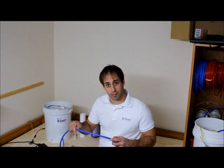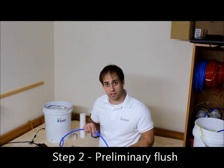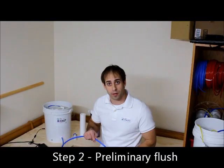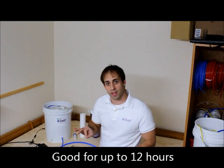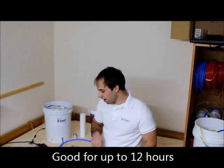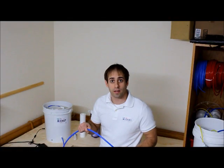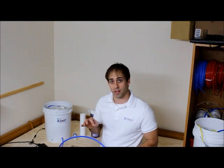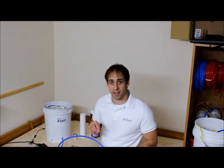Let the system run completely dry until it starts passing air. At that point you're going to go to step two, which is your preliminary flush. You're going to want to insert your intake suction strainer into five gallons of permeate water, leaving the needle valve completely open, and let that five gallons run through the system at full speed. Then pull the intake suction strainer out and let the system run dry again, leaving the needle valve open, until it starts passing air.